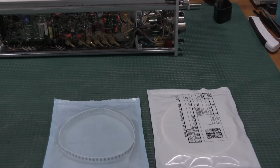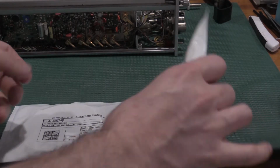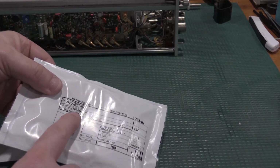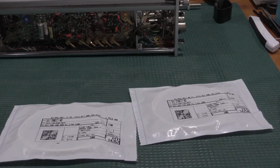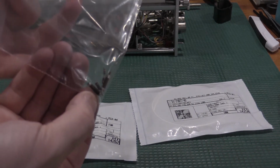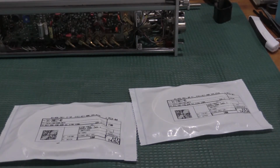All right, so our DigiKey order got delivered. We have some chip resistors. What are these? 390s and 270s, 5%, quarter watt, 1206 parts. Just so happens the 1206 parts will fit inside the back termination resistor. This little guy right here. Let me get some stuff assembled, and then we'll take some measurements and see how we did.